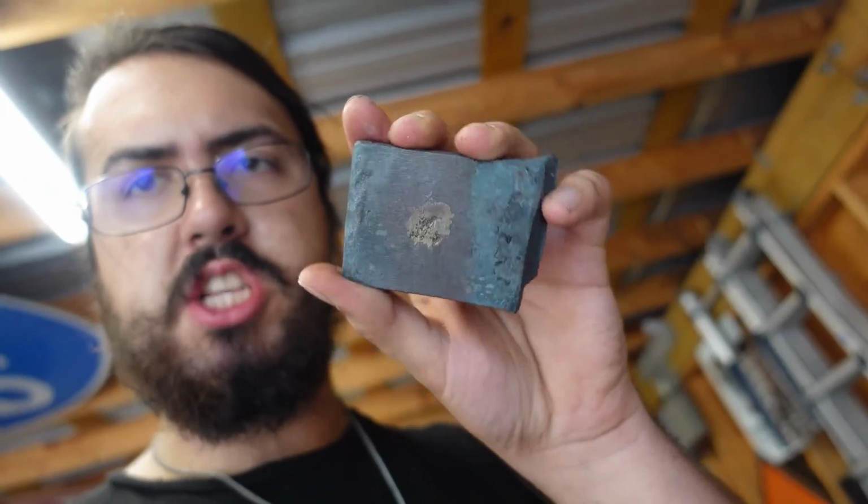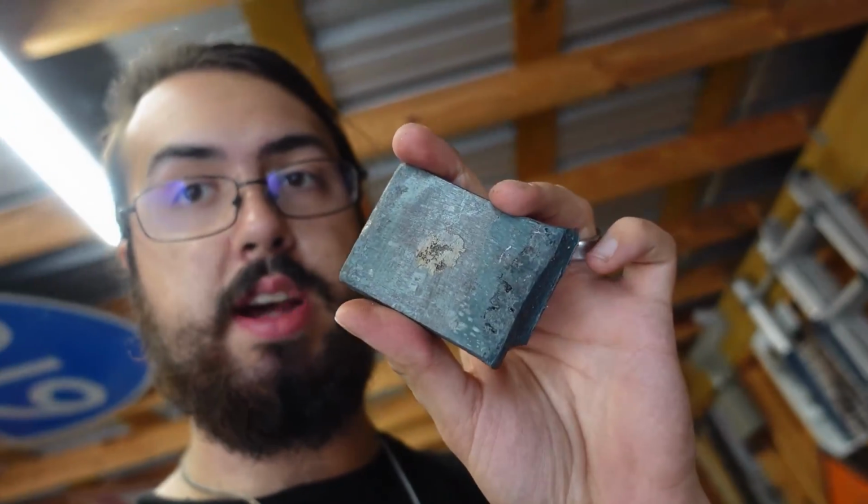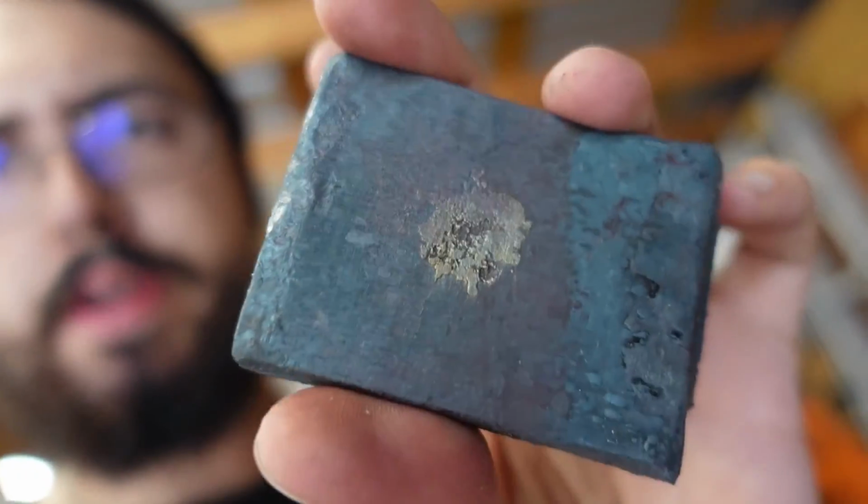Okay, I'm going to shut it down there for right now because the camera is getting awfully low on space, so I need to do some editing to clear that up. Off camera, I did a try at forge brazing to get the touch mark, and the initial brazing went nicely, but whenever I went to give it that new scale finish, you can see the bronze got all funky. So more practice will make that perfect.